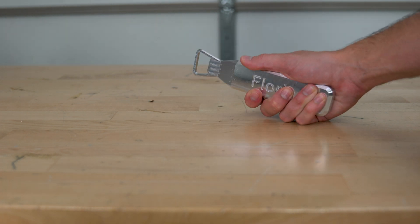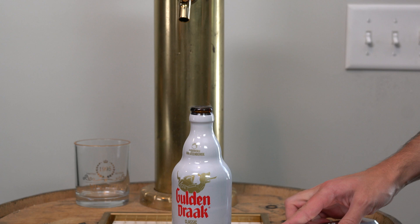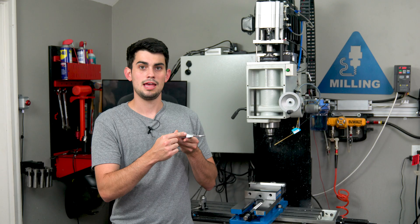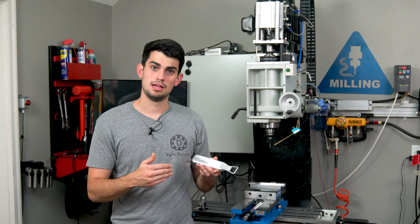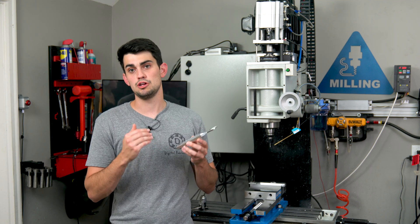It's quite hefty but feels great in the hand. While relatively simple to manufacture, I had to use 3D toolpaths to get this nice taper down from the handle to the bottle opening part. The size of the chamfer on the perimeter also tapers off on the slope down, and that was accomplished through using a scallop toolpath and a ball mill. I'm going to dive into how I machined this part and the steps needed to consistently make 10 of these with the use of soft jaws.